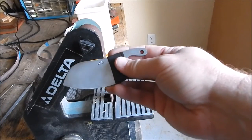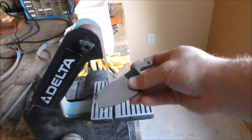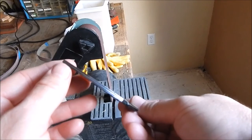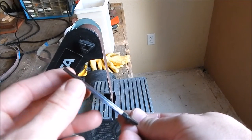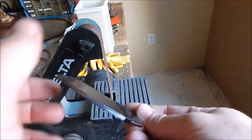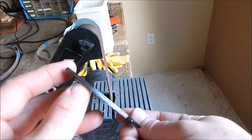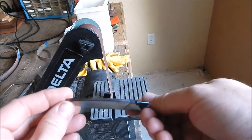Okay, I got the blade all polished up pretty good with the wire wheel. Now I'm going to do the grind. If you can see where the cutting edge will be, I colored it with a black Sharpie, and then you run a drill bit the same thickness of the blade on a flat table and score a line. What that'll do is give you almost exact dead center on where your grind is supposed to meet, where your cutting edge will be.